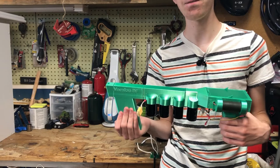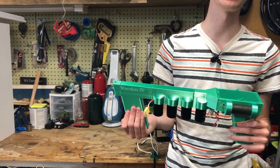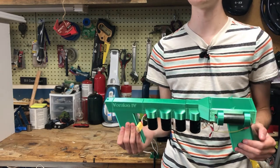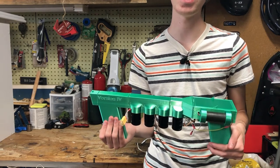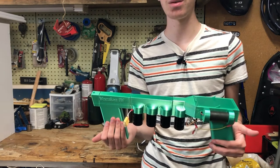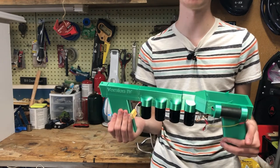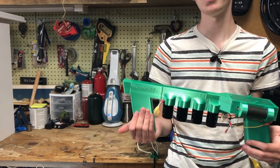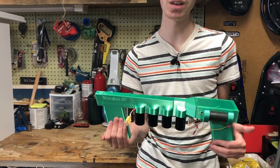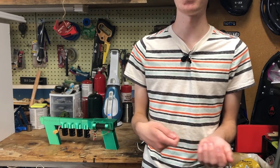It did at first, but coil guns have a coil that it discharges through, and that slows and evens out the discharge just a little bit. So what I think happened was just shorting the capacitor bank outright, it did not appreciate that. So pretty quickly, it broke, and it might just be that I was over pumping it. I was feeding it too much, but from the rating, I thought it would probably be all right, but who knows. Either way, it broke, and that led to, when I was trying to load it, it would explode. And that was really not a pleasant thing to have happen. And the breech mechanism never really worked.